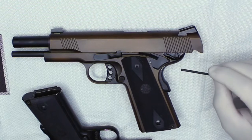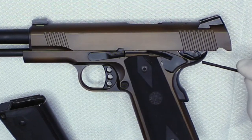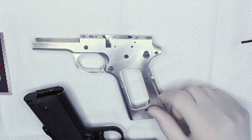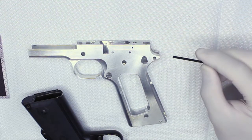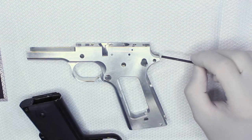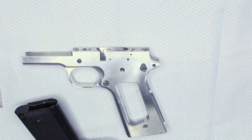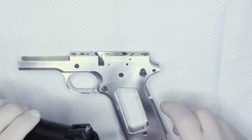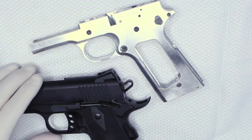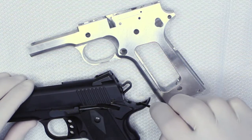Other grip safeties will work for the Stealth Arms frame, but we recommend using the Stealth Arms grip safety just so you get these lines. And here's an example of more of a 250 radius. What you get with a 250, usually the grip safety kind of rides up. In order for the lines to match, the grip safety has to come up. So that's why we chose a more 220/custom, to make the lines come down and swoop around instead of coming up so high into the hammer.